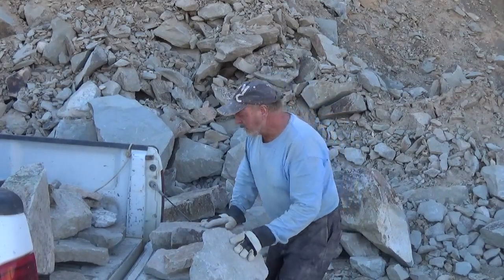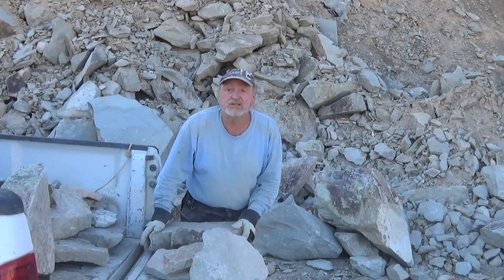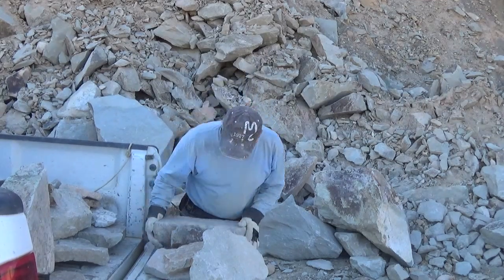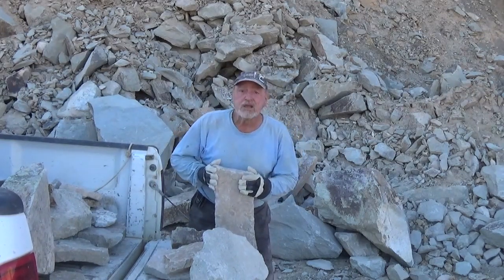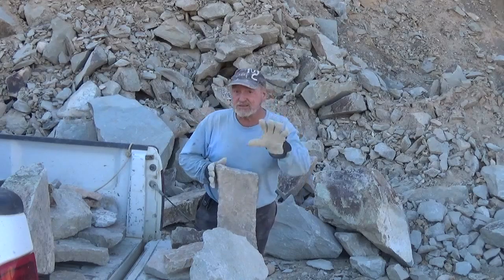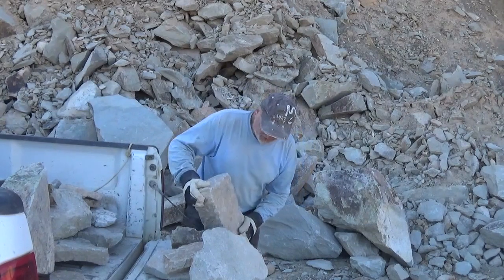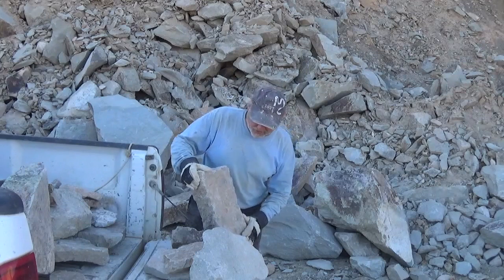Getting back to masonry — when you're picking rocks and don't know much about masonry, like a guy building his very first rock wall, they go for these chunky monkey rocks. They'll go for a big old square rock and try to stack them and stack them, and pretty soon they get up about this high and there's no stability. That doesn't mean you can't build a freestanding rock wall, but it's just not the way you think you're going to do it when you get these chunky rocks.